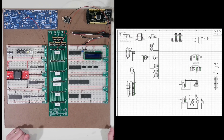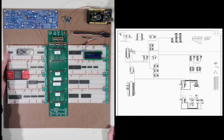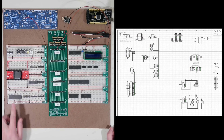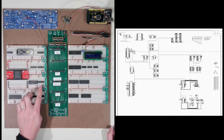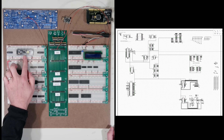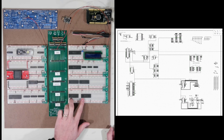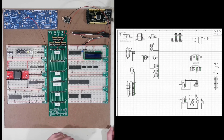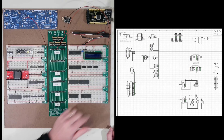As I walk through these chips, what I have down so far is the 286 processor itself. I have a clock generator. I have a bus controller. I have my interrupt controller. Math coprocessor. I have four latches that I'm going to use — these three will be for address, and this one will be for some control signals. I have a pair of transceivers for the data lines. I have my PSOC that's going to do address decode logic for the time being. Down to the lower right I have my ROM and my RAM. And then I have a pair of programmable peripheral interfaces, or PPIs — one for PS2 keyboard input and the other for an LCD output.